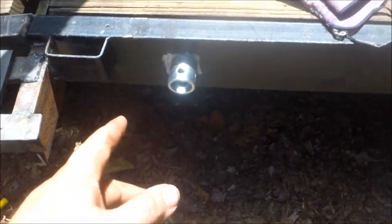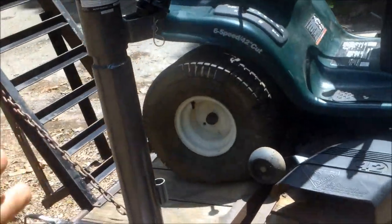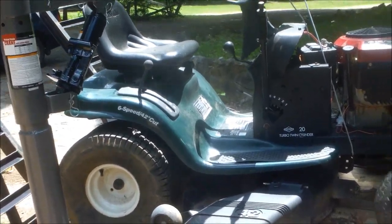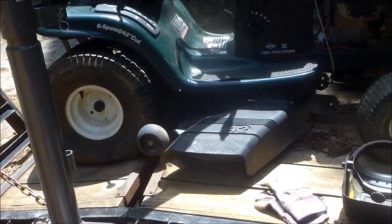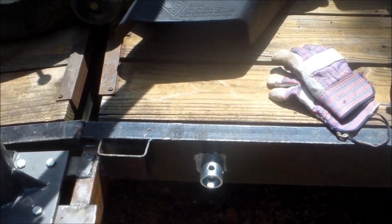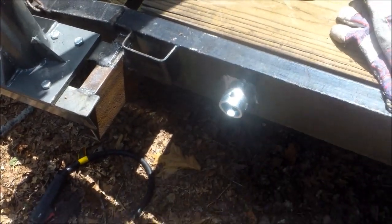Next I'm going to add this screw-style jack — there's a bracket to weld on. The idea is it will keep the trailer from 'tacoing' from the sheer weight of lifting something with the crane, which is about 500 pounds. I saw the trailer leaning really hard, so it's a good idea. I'll use a magnet to hold it in place, do some tack welds first, then weld all the way around. It's fairly thick metal and it's chrome too, but the welds turned out good.